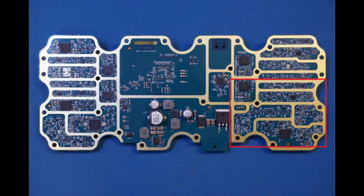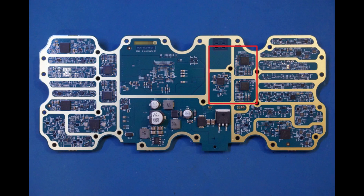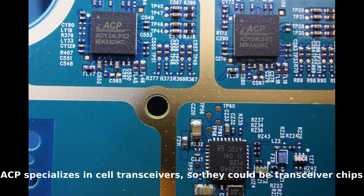Now we're looking at the bottom right section. The larger chip towards the bottom, which has the marking AWB7125, is a Skyworks small cell power amplifier that operates between 860 and 894 MHz. In this section of the board, we see two ICs of similar size to the AWB7125 that I could not find any information on. I am assuming they are responsible for some kind of signal processing, but that is just my guess.